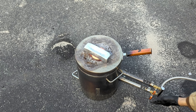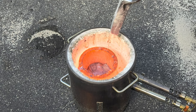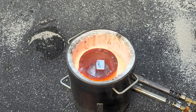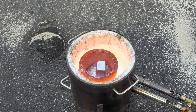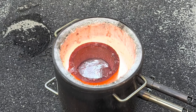Just to make sure I had enough aluminum for today's pour, I warmed up an ingot prior to adding it to the crucible that already has molten aluminum in it — you don't want to add a cold ingot to a hot furnace. What I like most about melting aluminum ingots is that they have minimal dross, so when the metal is fully melted you don't even have to spend time scraping away the dross that floats to the top.